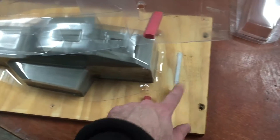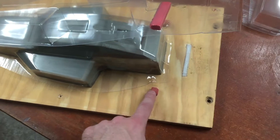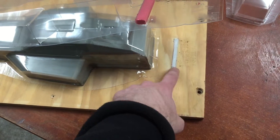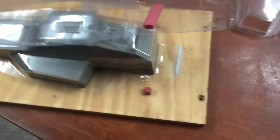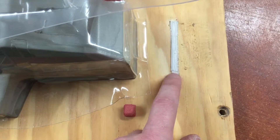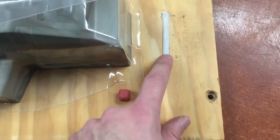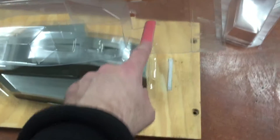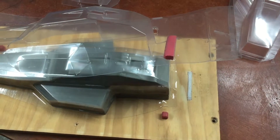So there's an example of why to use wooden blocks that screw in rather than foam relying on adhesive. You're getting this thing pretty hot, and the adhesive — unless it's really rated for that — is going to give out. If you look close here you can see there are two pieces of tape, so it came off when they were originally running it. If you're going to use this method, just know it's not going to last.